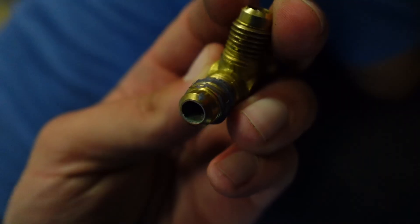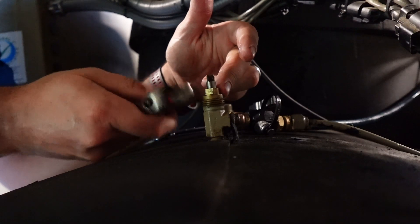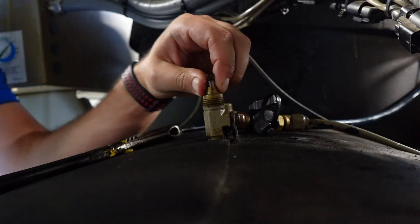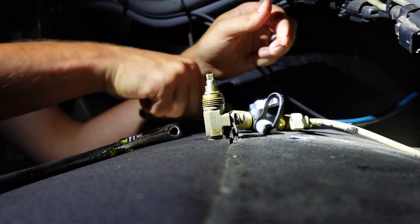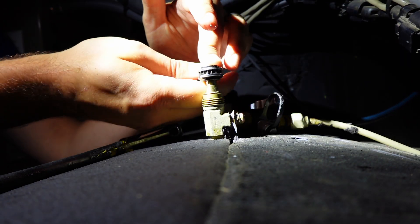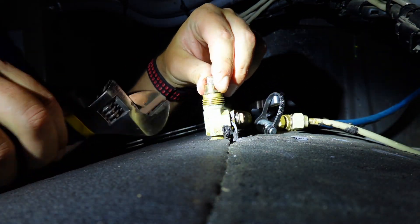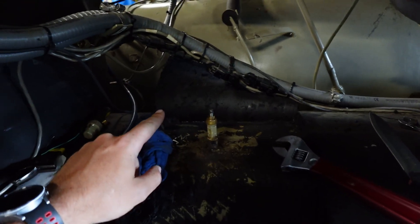When we took the lines apart we could see the internals had really heavy corrosion, so much so that we decided to replace the T-fitting I had originally installed years ago. At first we tried to pressurize the chiller and push the blockage back out the way it came in, but we didn't have any luck — we were only getting a tiny whisper of pressure through the valve. Our next attempt was to push from the top down into the barrel with 500 PSI on our nitrogen, but even with that it still wasn't moving. I even loosened the packing nut and tried to stick a small wire in to clear it — that wouldn't go either.